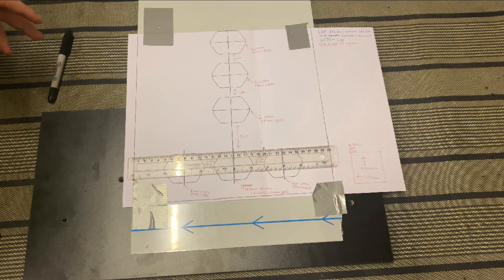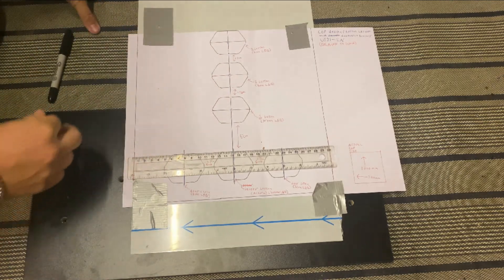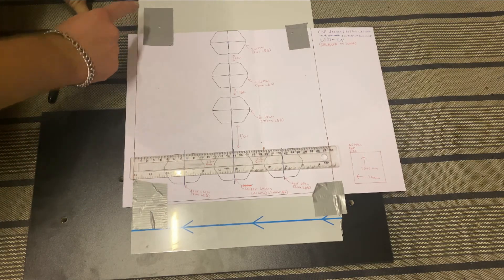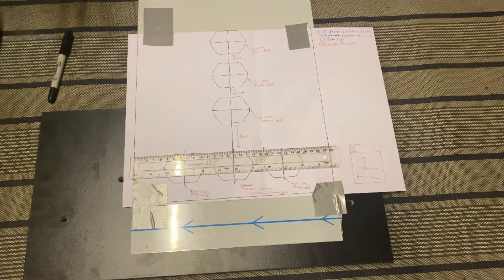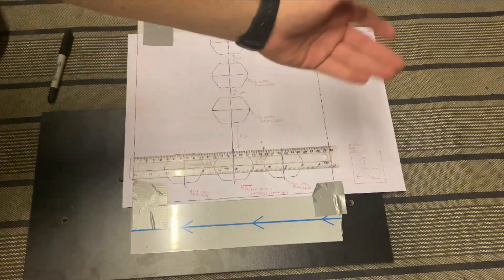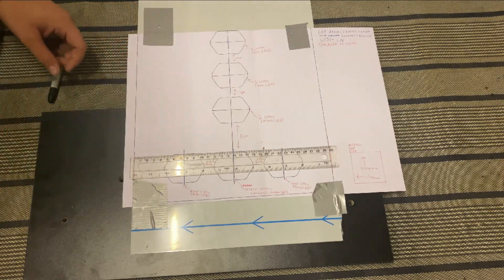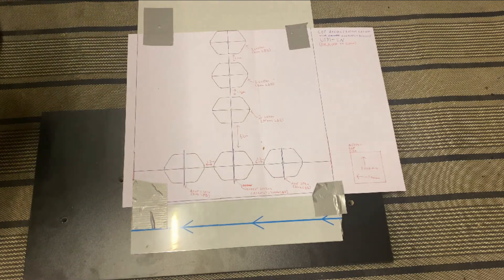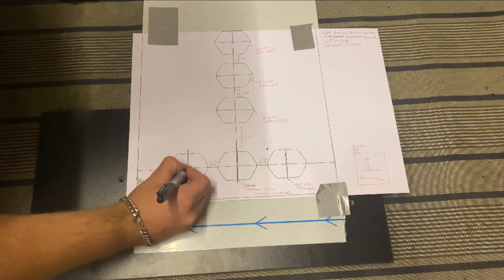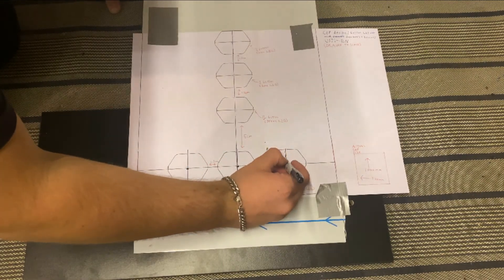For the markup, I've put the template onto the metal with some duct tape. I'm measuring from the side to the cutout position - it is 15 centimeters which is 150 millimeters. This is 300 millimeters wide and 300 divided by 2 is 150, giving you the center. So I'm happy with where this template is. I'll now put a little dot in the center of each position.